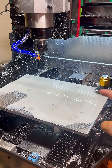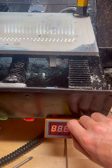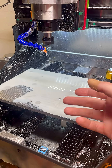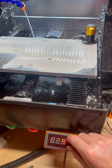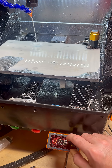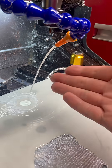Starting and stopping the pump, I noticed down here on my DC controller I have to be up around 90% just to get the pump to spin. Once the pump starts spinning and I have coolant coming out I have no problem coming down and adjusting it down. It's somewhere around the 70% mark I get a really nice, really smooth stream, which is exactly what I'm looking for.